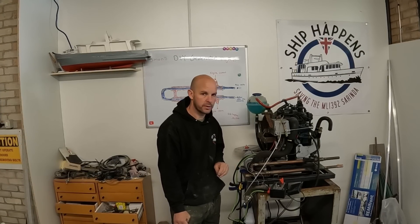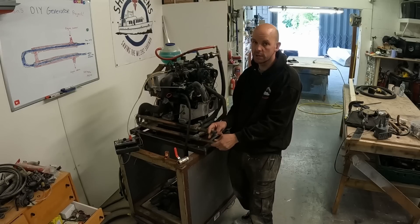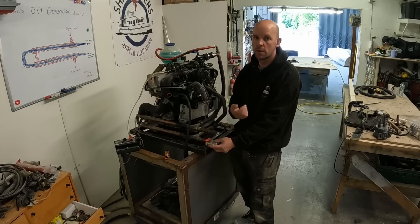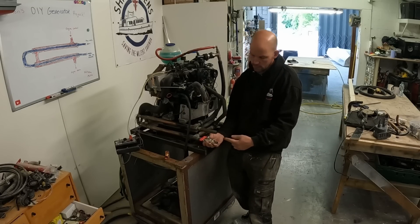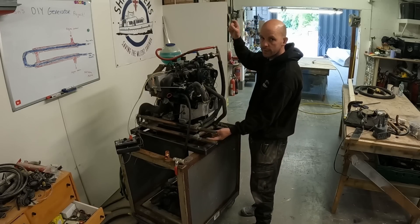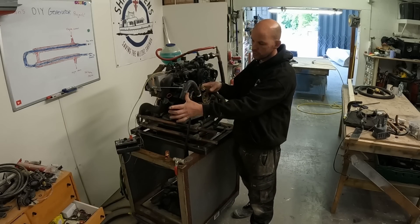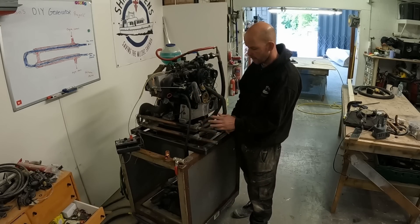And we're going to get some monitoring on the cooling system as well. So let's get stuck in. These two tubes here are for the auxiliary cooling - will be the seawater. I want to put a drain on the lowest part of the tubes so we can dump any salts if we need to, or give it a flush. I want this to be a straight run so I can give the tubes a clean, with a straight approach to clean through. That's going to go on there, but then we need to tee off on this one - which is going to go to the radiator, which will be what goes into the exhaust at a later date. We've got a raw water pump, and a nice silicone U, coming off this one here and going straight down to the top. So we need to put some more copper in here. I think that's where we'll start.